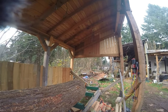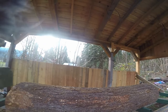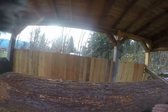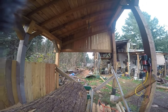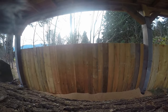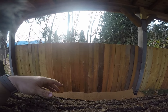After I built it, I noticed pretty much all of our weather comes in from this direction — we're backed up against the Cascades Range here and most of our weather comes off the coast, which is west, but occasionally we get east wind, so it would blow in quite far. I picked this height because I can easily walk under it. It starts at six feet and tapers down, so I added two-by-sixes as you can see, had my angle figured out, and just took a bunch of scrap one-inch boards, put them up there, and screwed them down, then went along and cut the bottom off.